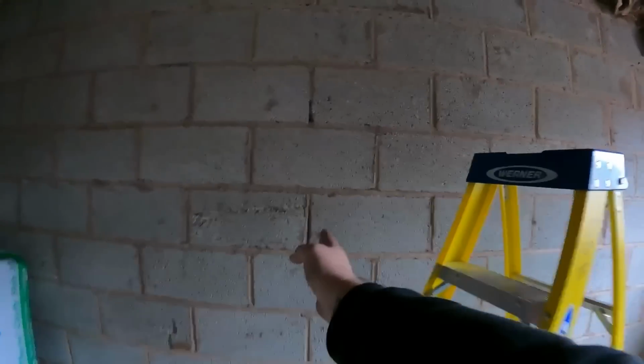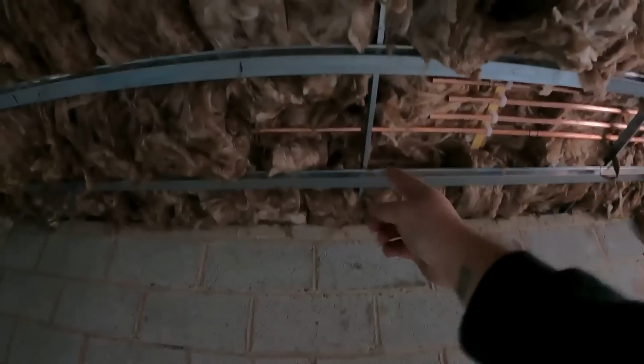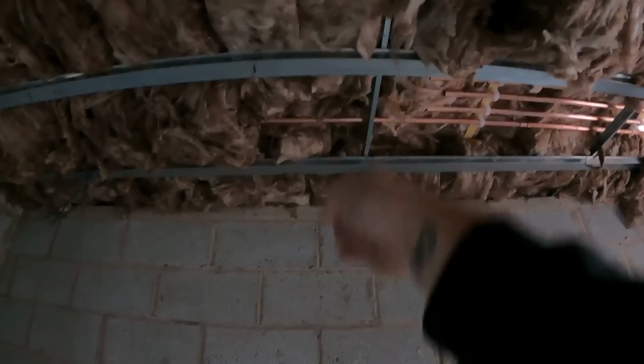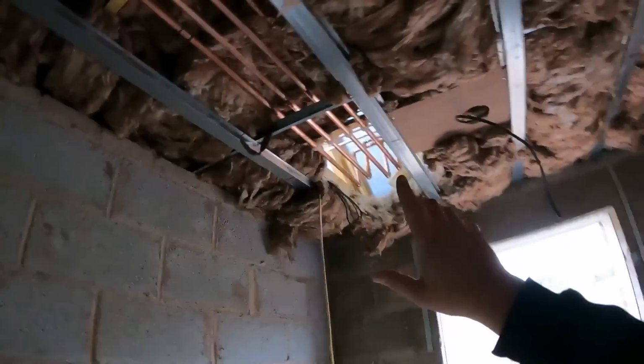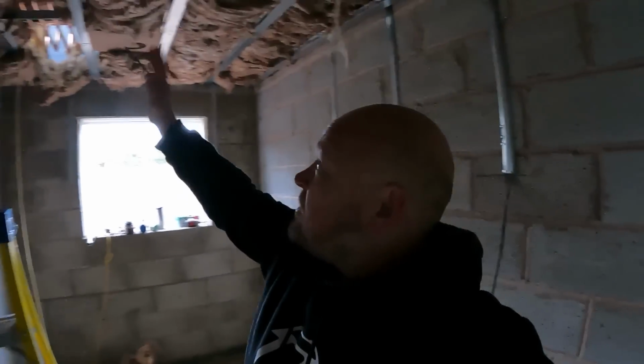That leaves Monday when I come back, because the edge of the shower where the stud work is gonna go is just there. So we're just gonna have to come off the edge, obviously with some couplers, and bring it down in the stud work. But it just means that we can fill this bit back in, get it all lagged, and get it all sorted, and then we can finish off upstairs lagging the pipe work as far down as this point.